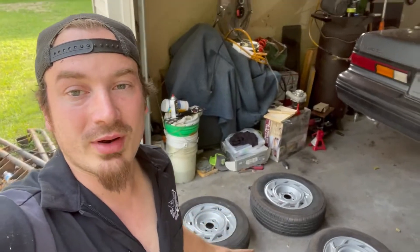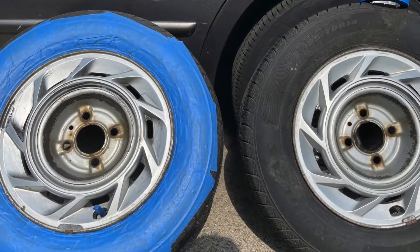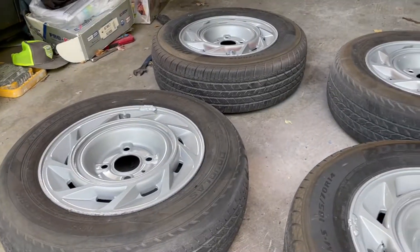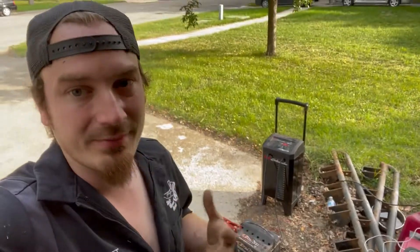We got the wheels done today. These are actually a rubberized cover over a steel wheel, so I cleaned everything off really well, got in the hubs where the rust was, ground all that back, used some rusty metal primer, and then got them looking how you see them there. Again, like I said, we spent $400 on this project and it needed a battery.